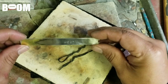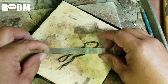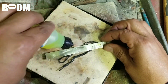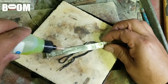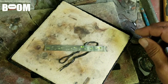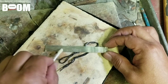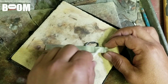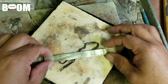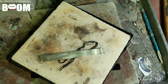I sanded this side, and what I decided to do for these arches is tin this. I thought: if I put solder on the feet of each one of those arches, once that solder melts onto those feet, it's not going to melt flat — it's going to melt like a ball, it's going to have a dome to it, and then those arches will never sit flat because they'll want to fall over.